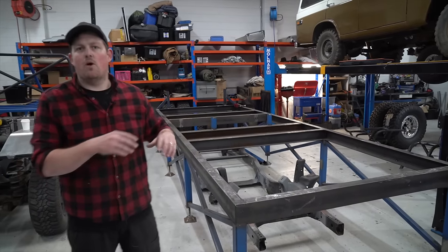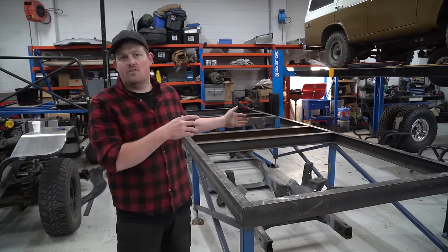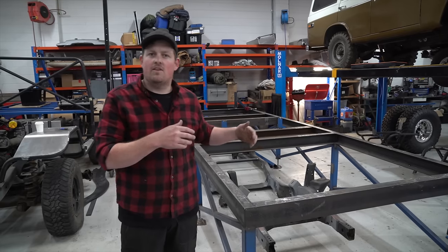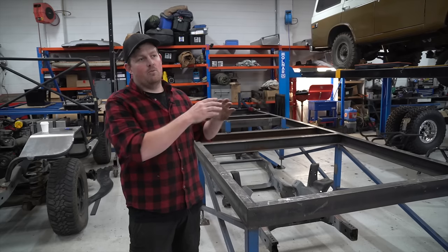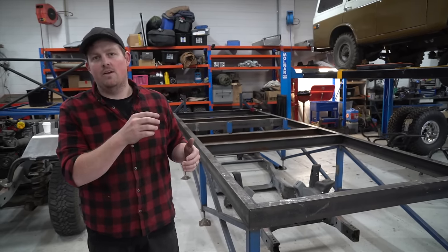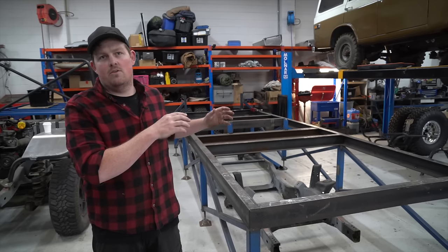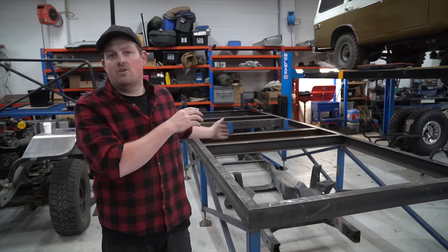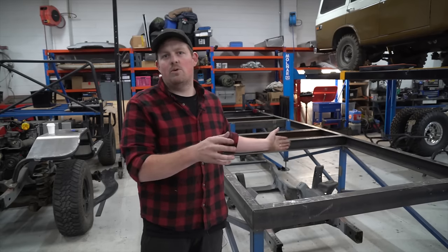With this build, although we're not actually cutting the entire chassis out in sections like you would for a slammed hot rod with airbags, or a C-notch where you remove an entire section of rail — we're not doing that. But we are taking out the majority of the chassis at a few certain points. This will allow us to weld the chassis into location on the table with no distortion or warping as we do all the modifications.